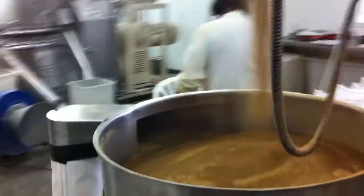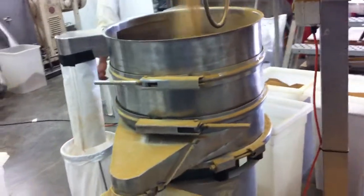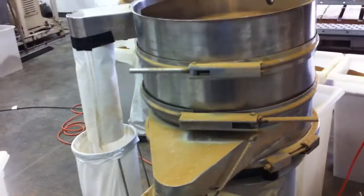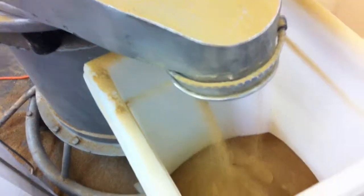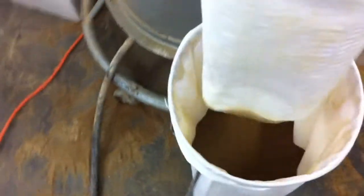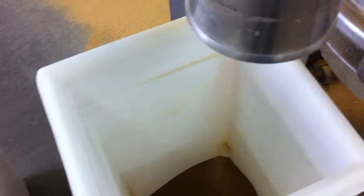Running up this conveyor and into a screening process — these are just vibrating screens. It's taking off the various sizes: your fines or dust, your margin particle sizes, that's 1.4mm, and that's the 1mm product here.